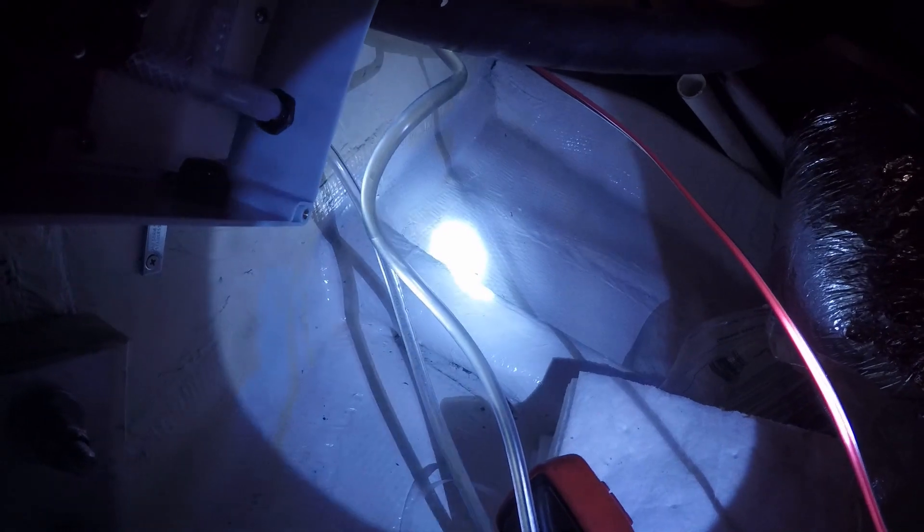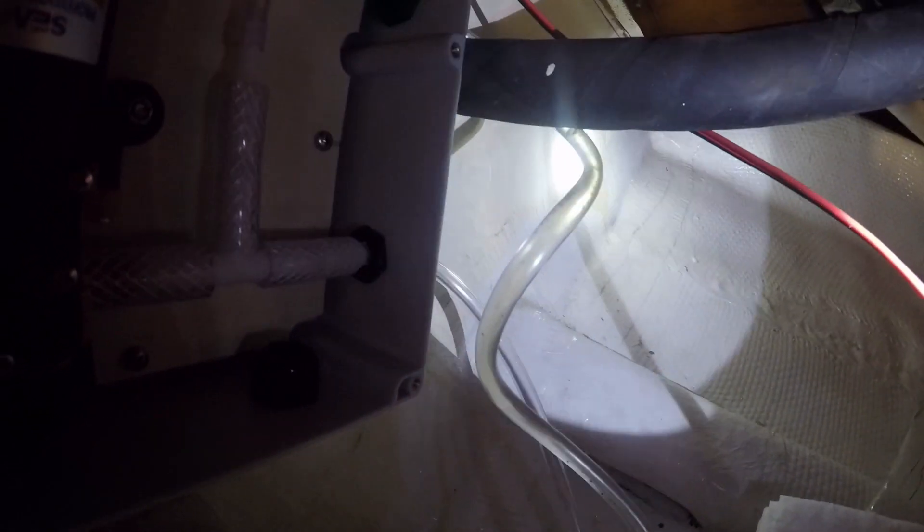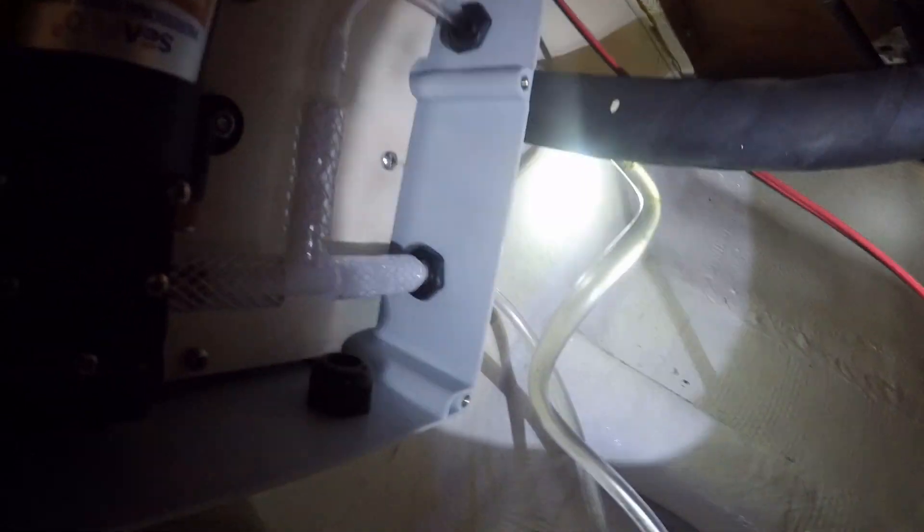This is how the system runs, and I'm not happy with the suction. I had two lines running back from the two pickups, and one is pumping better than the other one — the other one just seems to get a vapor lock.